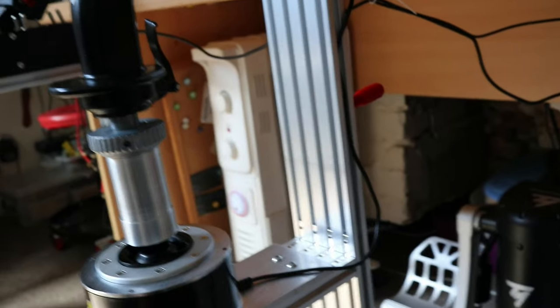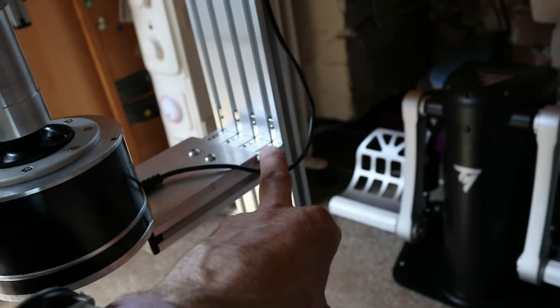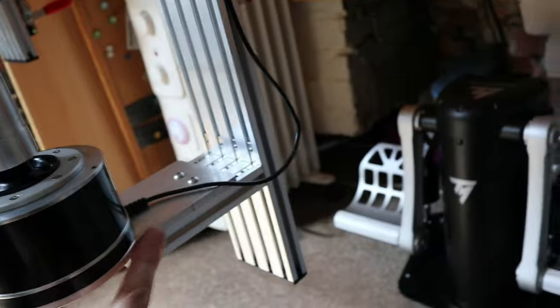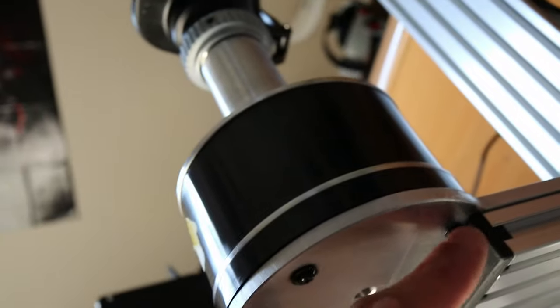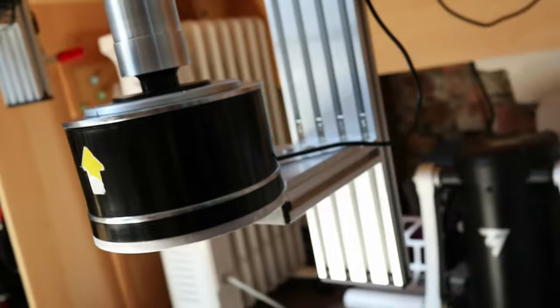Initially I got three of them, but it depends whether you're doing this upgrade as well. You can see I've got the brackets, and I'll show you them shortly and leave the links. There's the aluminium plate, which goes all the way around, and if I get underneath, you can see I've just bolted it on like that. Say I needed to go closer, I could go closer by about another inch, 25mm or maybe 30mm. But I can't, because I haven't countersunk these, which is not a problem. If I wanted to, I'd just take them out and countersink them. But it works for me.